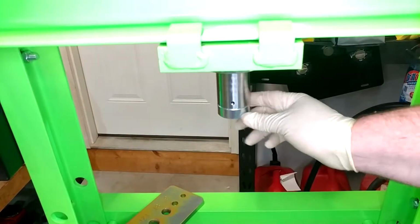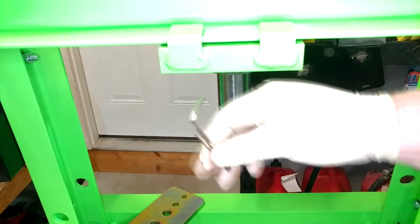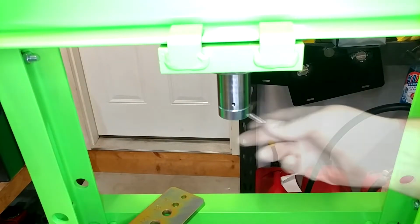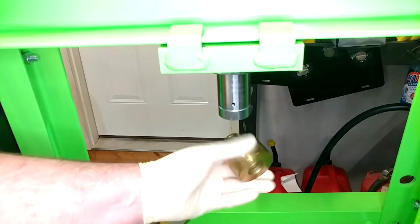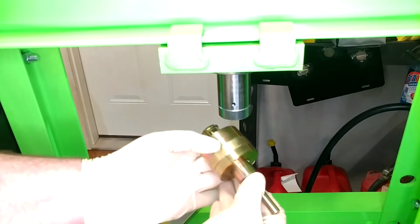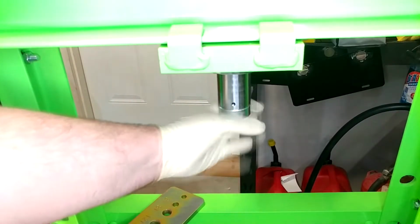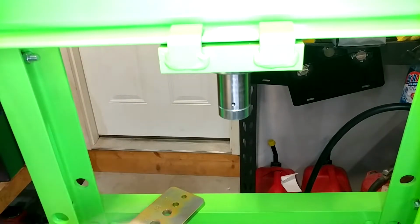And the final mystery to me was what was going on with the ram tooling. Again, in that separate bag that had the hardware for that side mount, it came with these 2 Allen wrenches, one of which I still don't know what it does, but the other one gets in here on a set screw, and then you can remove that chunk and install this chunk in its place, and that is your quick change for all the tooling on the side of the machine. That's why they all have these ball detents, because you can meet them up just like that. So that's pretty cool. On the Harbor Freight machine my dad has, to do stuff that's smaller than the ram, you're stacking up sockets and it's not great. I'm really pleased to see that quick change system.